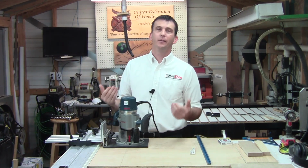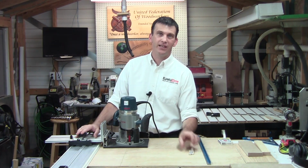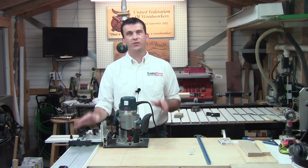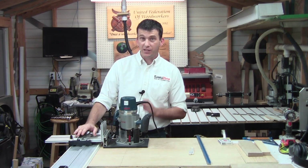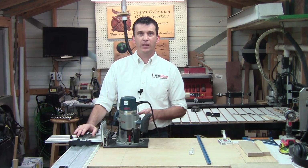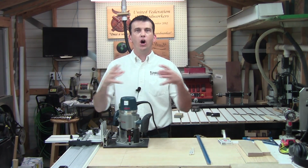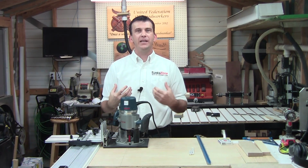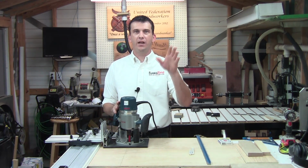All right, so we're going to get a little bit closer now so we can focus in on the Y limit stops and the little setup bars that I make in my shop, and a couple other things I use for my setups. And I'll show you how the Y limit stops, the specific router bit that I pick when I'm doing my routing, and my little setup bars for each job that I'm doing, all work together to allow me to achieve repeatable, perfect results each and every time, whether I'm in the shop or out in the field.